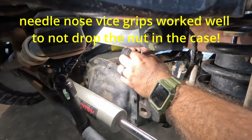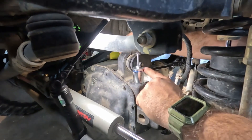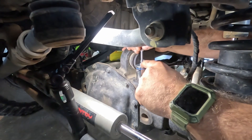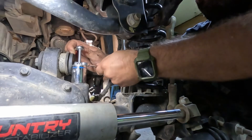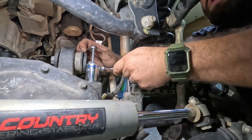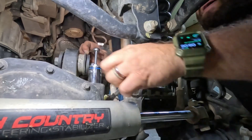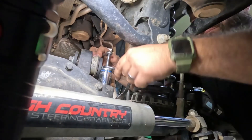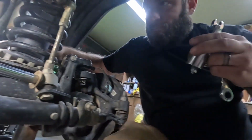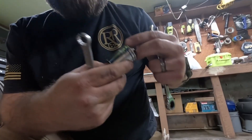I fished my little nut in there — there's not enough room to get the camera in, sorry. So what I've got is the quarter inch bolt, a nut on the bottom end, a nut on the top end, and I'm going to tighten this one until it pulls the plug out. This is a very slow process — you're just turning your wrench a little at a time because it's a very small area, but you're eventually going to get that piece pulled out from the bottom. And there it is — there's the broken plug. Now we get to go put a new one in.